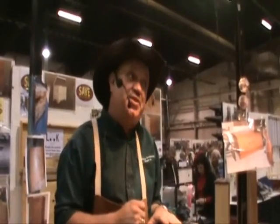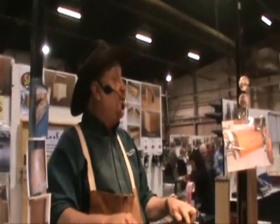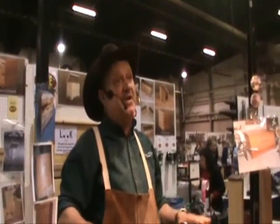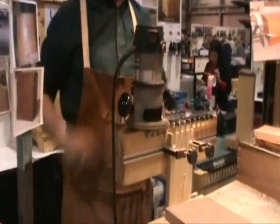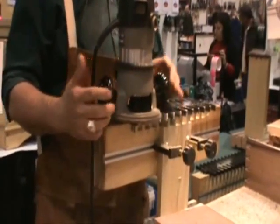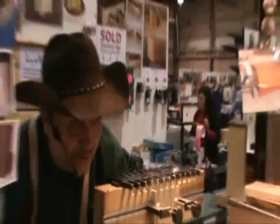But there's something in our manual that is very important, and I like to share it with you. In our manual, we tell you that if you're holding the router, never cut the last slot. Why? Well, there's nothing on the side to support your router. So if you don't have a firm grip on it, it could tilt. And we don't want you to hurt your jig, and we don't want you to get hurt. So I wanted to share that with you.